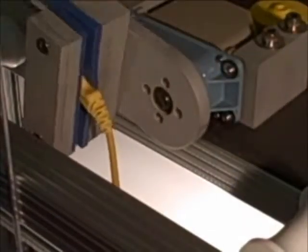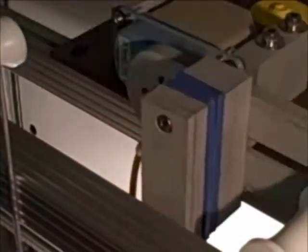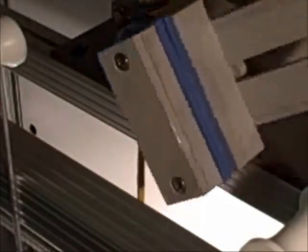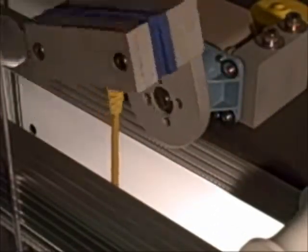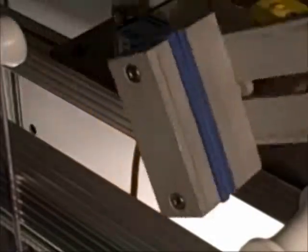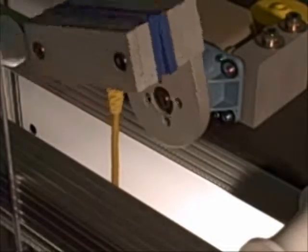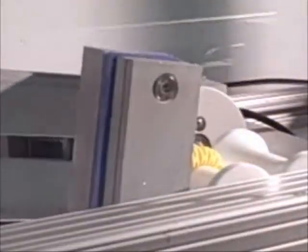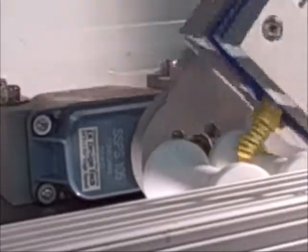Strain reliefs are a major area of failure. West Tech's cable flex tester attacks this area to ensure complete reliability of every connectorized cable design that West Tech manufactures. The test pictured here shows a 45 degree angle bend fatigue test with a specified weight pulling against the strain relief. Shown here is the next test imposed on the strain relief.